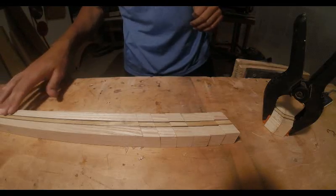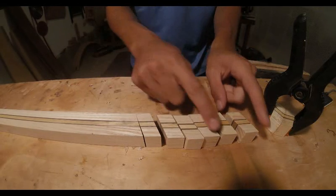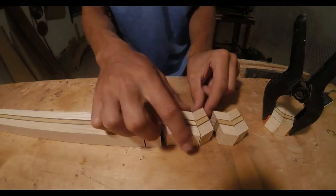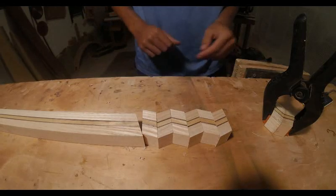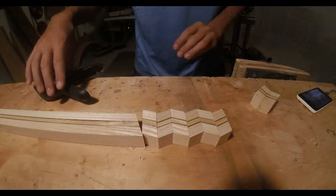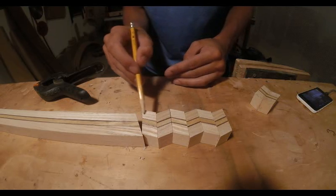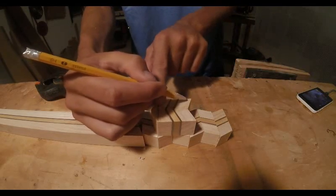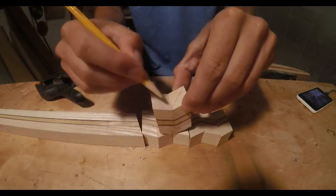So how this will work is I have the board here and I've cut these pieces off like this. When I flip this over, they get into a chevron pattern — something like that — and I can glue them together like I have with this one. Then what I do is cut with the table saw along an edge here and here to give me square pieces, and from there I can cut the angles that will form the ring.